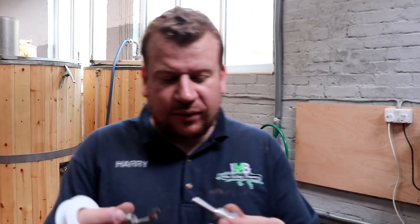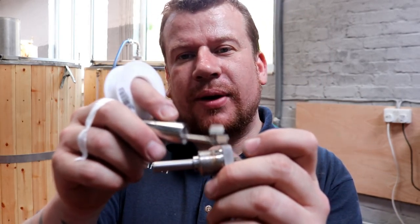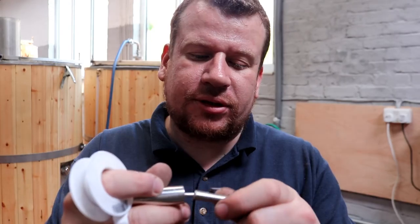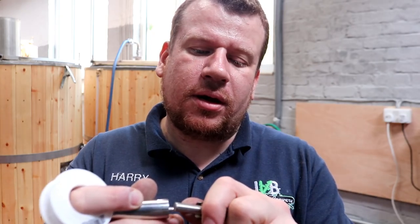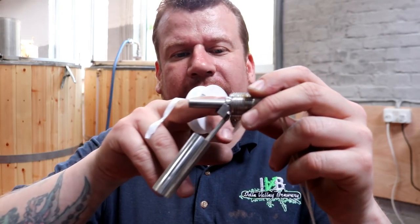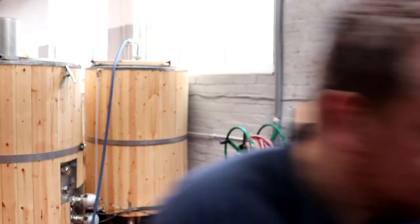So first things first, we've got the float valve. Indicated on the top there, there's a little reed switch on the inside. We know where the top is because I put a mark on. And all we have to do is just slide this little float onto the piece of equipment like that, and when this is engaged, it closes a reed switch on the inside, which allows continuity through this little cable that I've welded on here, and eventually will send a signal through to the relay that it's okay to power the solid state relay.